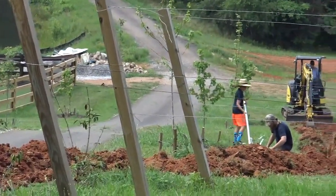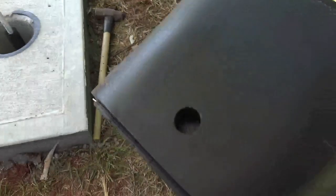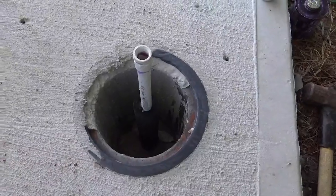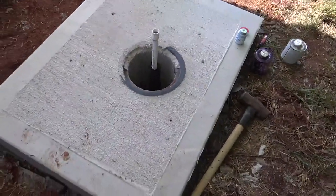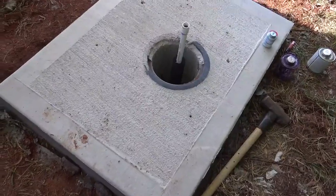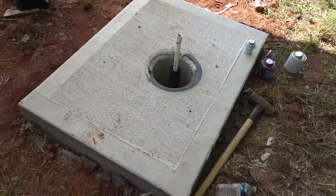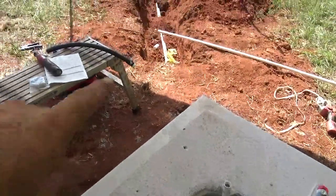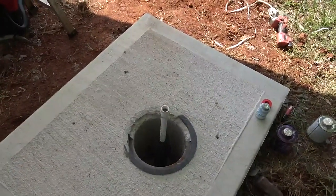Our concrete has hardened up and we can put our Mirafounts on — these are the 3465 model. We're going to line up and attach to our plumbing coming up inside the heat well. We've got a hammer drill to lock the box down, then we begin plumbing the internal float mechanism. We have three of these to do. We're supplying the whole farm with inch-and-a-quarter pipe and step down to three-quarter right at the Mirafount.